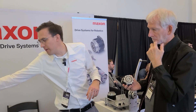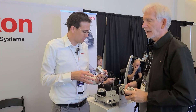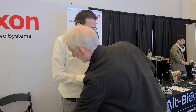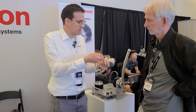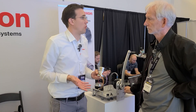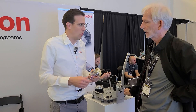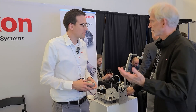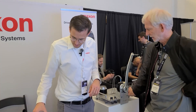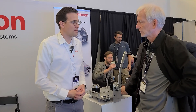We do have a family of drives with hollow shafts — those are strain wave gear-based drives. But we don't use those for humanoids; these are more bespoke OEM systems. They don't have the controller built in. We typically use those for medical robots, surgical robots, where you need to position arms slowly and precisely.